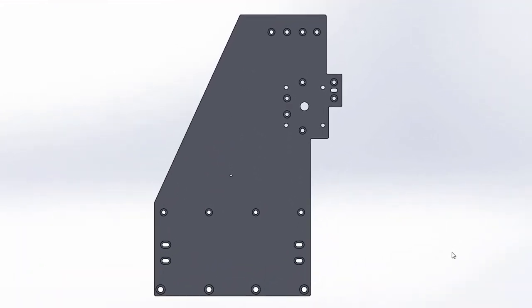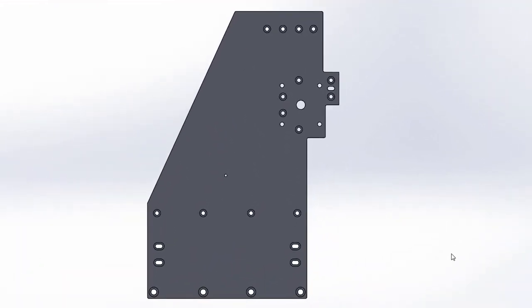As you can tell, I've come up with my first revision of a Y plate. The bottom of it pretty much runs on the basis of my X gantry plate, and where the stepper fixes, it's basically exactly the same as the corner plate bracket, but sitting inside the Y plate. And of course the addition of the extra 20x40 at the top and a 20x40 at the back, which will also add some stability and somewhere to run the cable chain across.